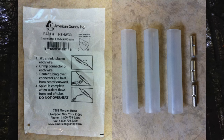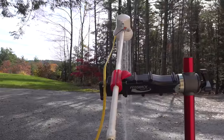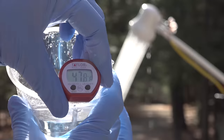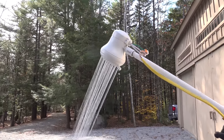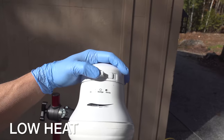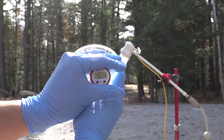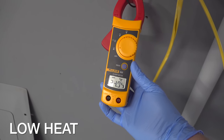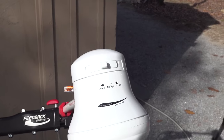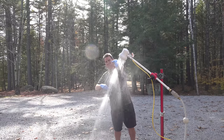With the head connected, I started by turning on the cold water and measuring the temperature of my New Hampshire well water — 47 degrees, which would not be fun to shower in. The pattern of the shower head looks surprisingly good though. Now for the good part: we turn the circuit breaker on. I can already feel the difference in temperature. Using my clamp-on ammeter I measured 34 amps on the low setting. Switching to the maximum high setting, the amp meter showed we are pulling almost 48 amps — that is a lot of electricity to have right above your head.